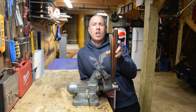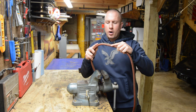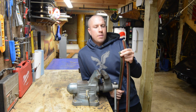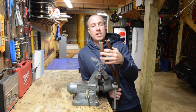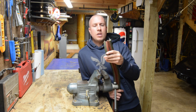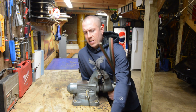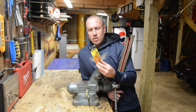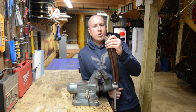I'm going to cut them off flush — they kind of just blew up at the end. You can tell where they blew apart. It ruptured just the oxygen hose, so the acetylene hose was fine, but I had to cut them both. My buddy lopped it off where it burst and I thought about making two hoses. Forney makes end kits and unions, so I bought both just in case, but today we're just going to do a union.